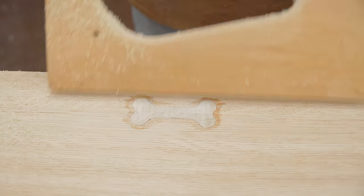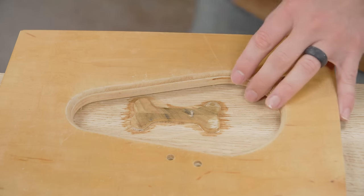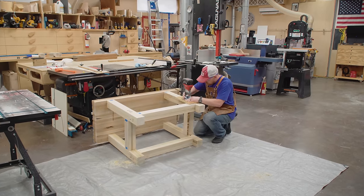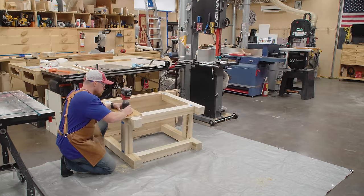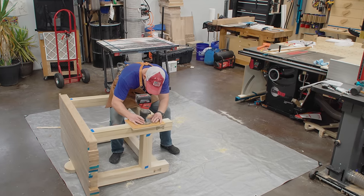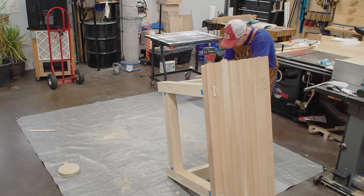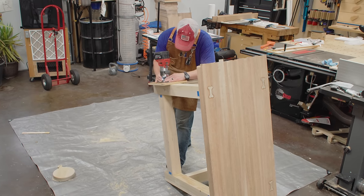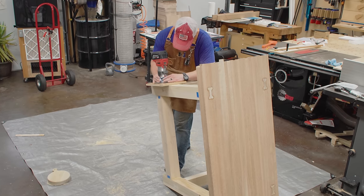This is super convenient and super handy — I didn't have to make another jig, just a piece of plywood with a hole in the middle. There are four of these tenons on the top surface because all four of the legs go all the way through the thickness of the top, and all four of the rails go through all four of the legs on each side. So there are eight on the bottom, four on top — twelve total that need to be trimmed nice and flush. The workbench is sized small enough that you can just tip it and roll it to get a horizontal surface on top.